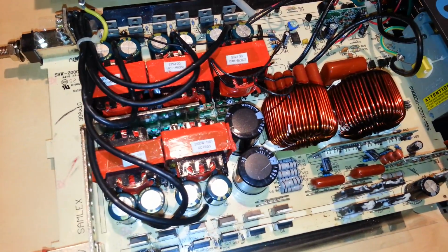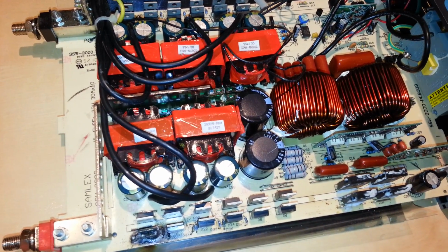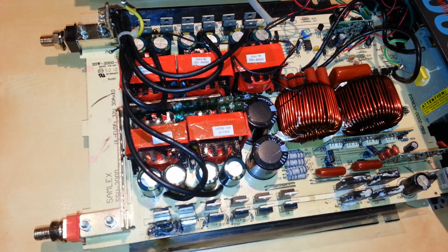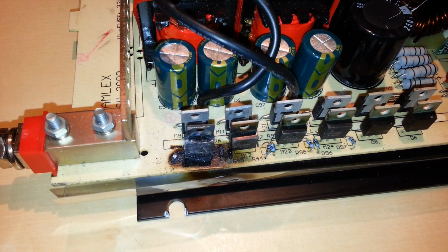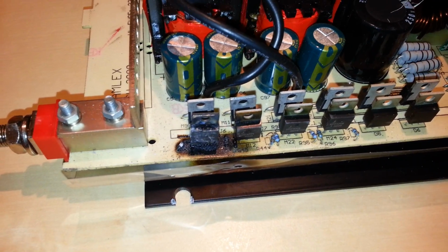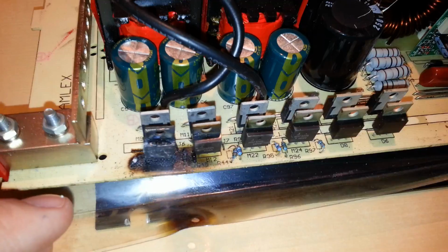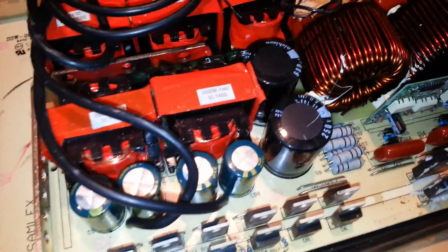And just to give you an idea, and this is a shout out to NeuralNar, I'm really going to be looking to some of your videos again as a roadmap to start doing some diagnosis on this. But from the electronics background that I have, it doesn't really seem too hard to figure out what's going on here. As you might have already seen initially in the video, the input stage MOSFETs have one of them decided to catastrophically fail. Yeah, and that seems to be the catalyst of the problem, at least for the initial assessment.